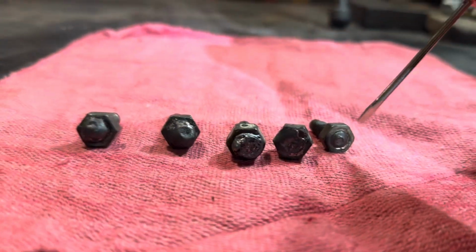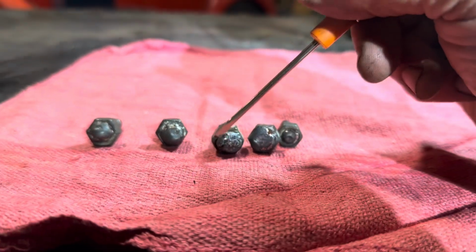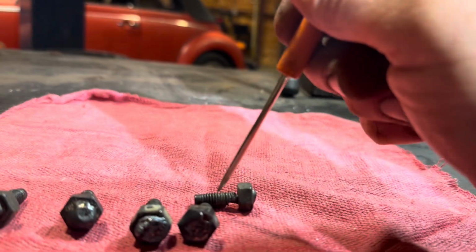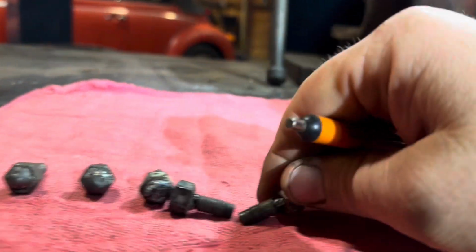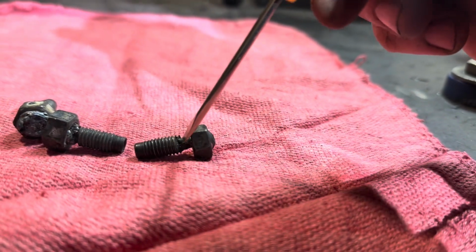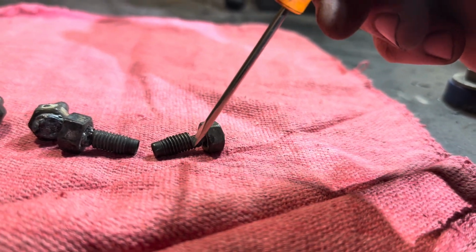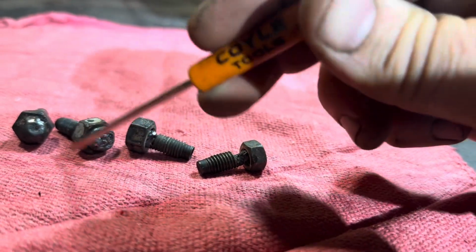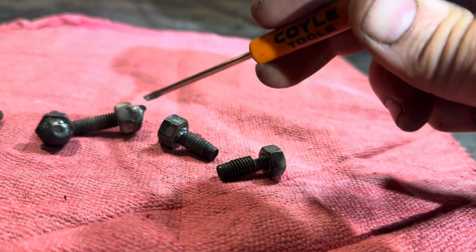You see what I've got right here? See how that's a closed-in weld pool and all that? Now look, not all of these, see how that's just a stack of BBs right there? See the taper on that guy? Let's see if we can get the camera to focus. See how it's not straight? I had to just come in with BBs, just tap it up. Same right there. Same right there, right?